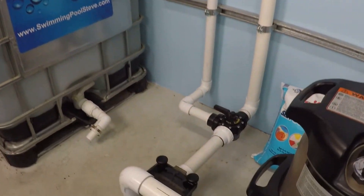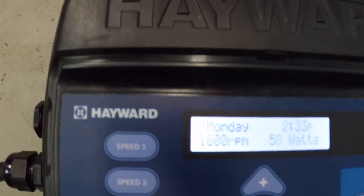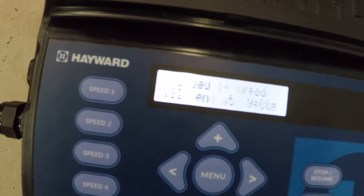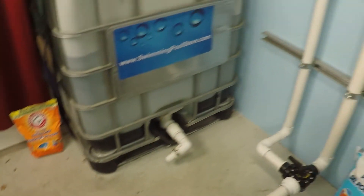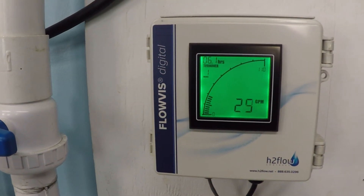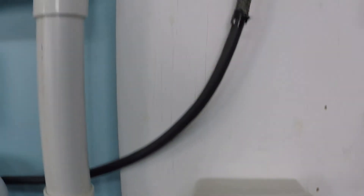Let's go ahead and take a look because this pump's already running. This pump is a little bit hard to see because I've got an overhead light, but you should be able to see now — 1,000 RPM. So at 1,000 RPM, referencing the digital flow meter here, we're getting between 25 and 27 gallons per minute. We're aiming for 25, and that seems to be where it's settling mostly.